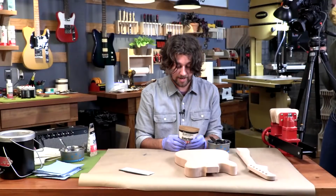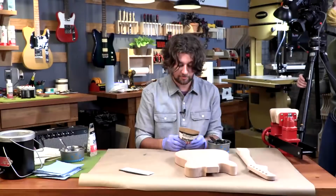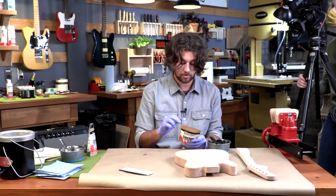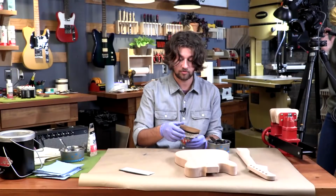Then, when dry, wipe off the remaining residue with a dry cloth. Let dry before sanding. Color will change to a chalky look. Sand the surface with 320 grit sandpaper. It can be sanded after 1 hour. Clean up with warm water. You may need additional applications to get a level surface.